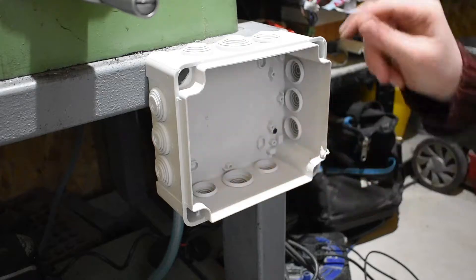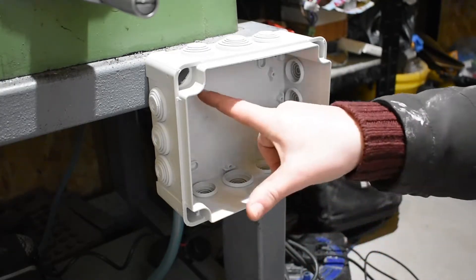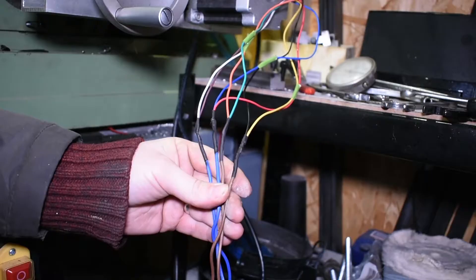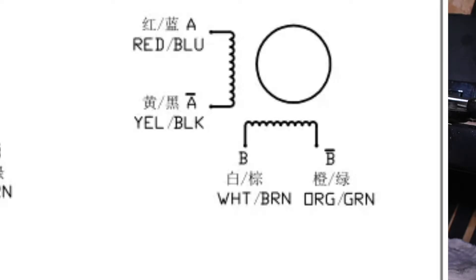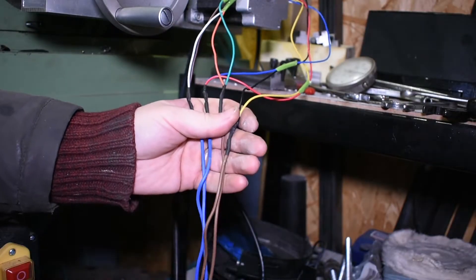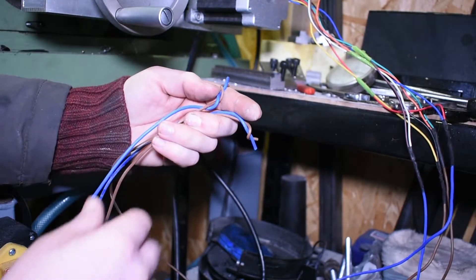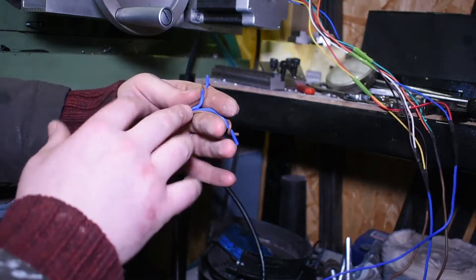I've got the box fixed on there now. All I've done is drilled and tapped the steel frame M4 and used two M4 cap head screws to hold it on. Two is enough — there's not going to be a lot of load on there and it's got a good hold. I've taken the eight cables from the stepper motor and paired up the wires for the positive and negative for the two poles, then wired them into two positives and two negatives. On the other end I've tied them together so I know which pole is which, and now I'm going to put them inside heat shrink to keep it tidy before wiring into the stepper controller.